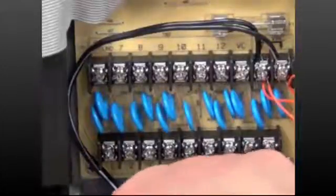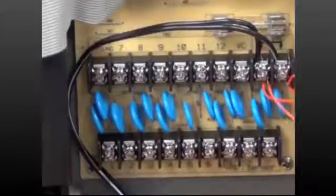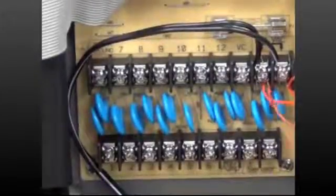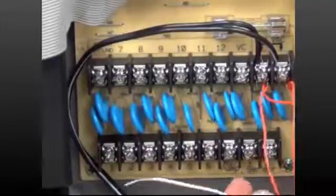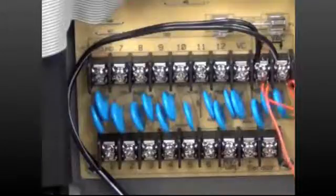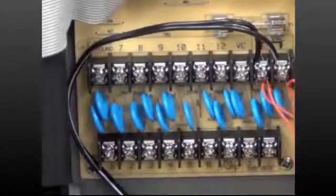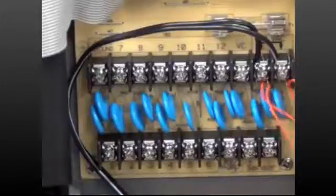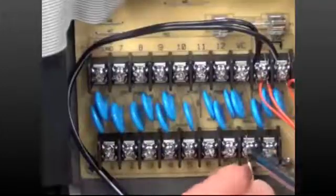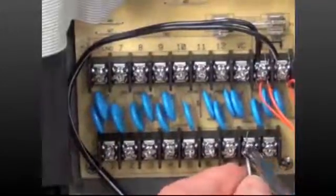Now that we've got the red wires hooked up, the next step is going to be to remove the jumper from the sensor terminal on the controller — just like that, and it falls right out. Now we're going to take one of the sensor wires from the rain sensor and one of the sensor wires from the precision soil sensor — just one from each. It doesn't matter which one; we could use the brown or white. The important thing is we're only using one from each. Hook one into one of the screw terminals — right now I've got the white wire coming from the rain sensor.